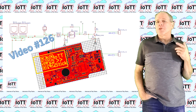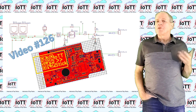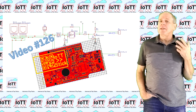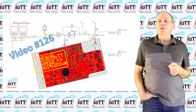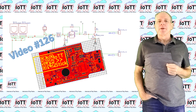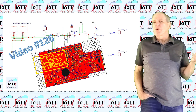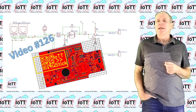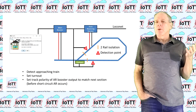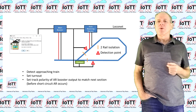The second problem with that first prototype is that it only supports DCC. As I was adding features to the booster software I realized that it would be beneficial to also be able to send messages to the command station or a computer, at least as long as the booster is connected to a loconet system. Furthermore it would give access to more message types than just turnouts and signal commands which can be communicated via DCC. It would be possible, for example, to set the polarity of an autoreversing section based on a block detector input received via loconet.